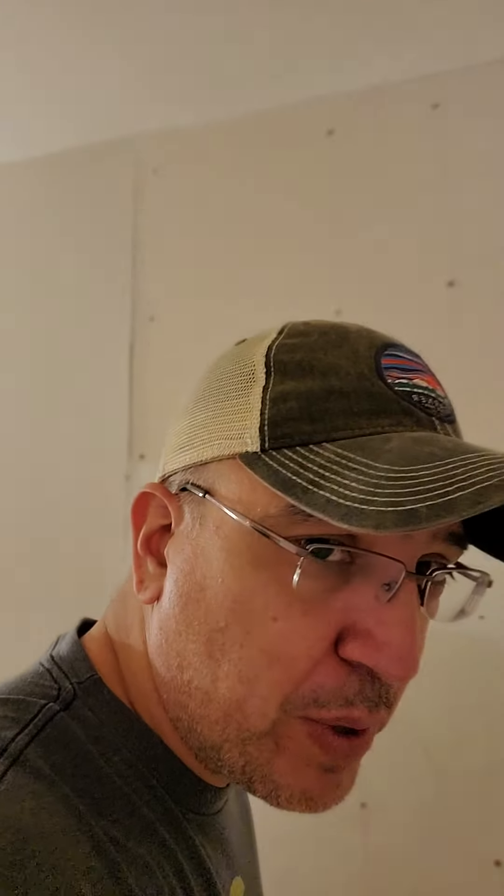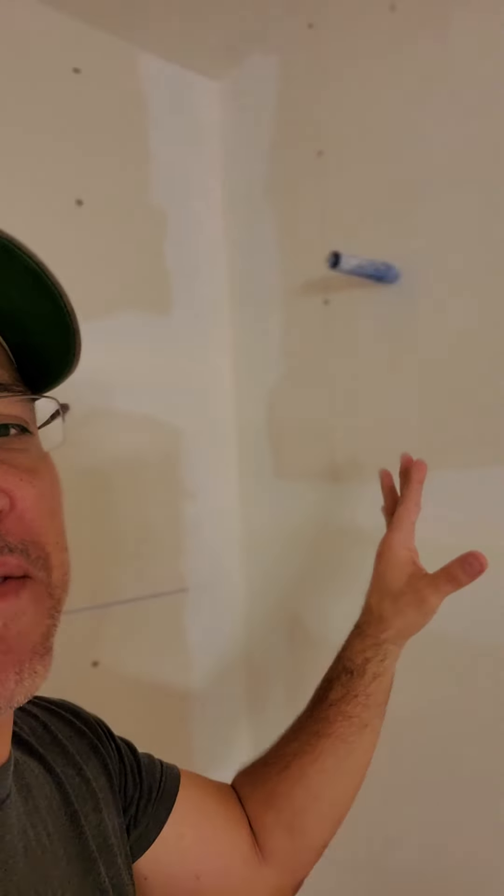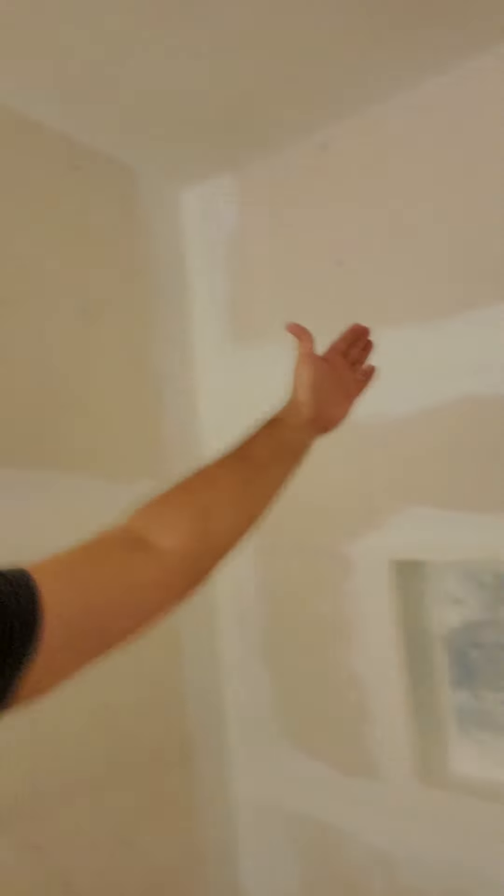They're going to paint the bathroom, and then the wall tiles are going to go up. For the walls, the spacing is 1/16th of an inch — that's what's recommended. They'll use the same little spacers and space it out. This video isn't about showing off the renovation — it's about showing you what to expect if you're looking to do a renovation in your house. Be prepared, because it gets crazy loud.